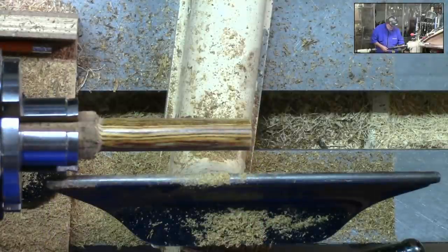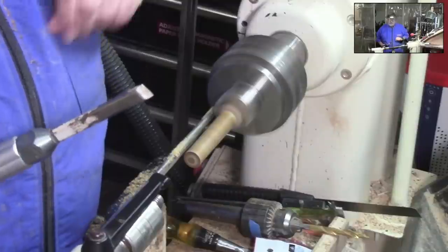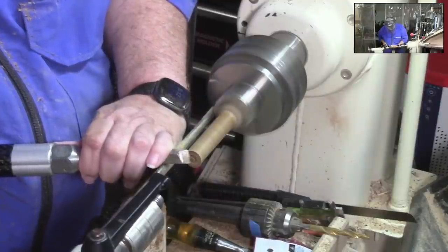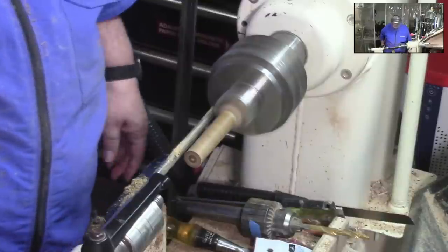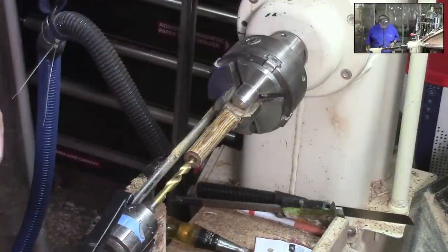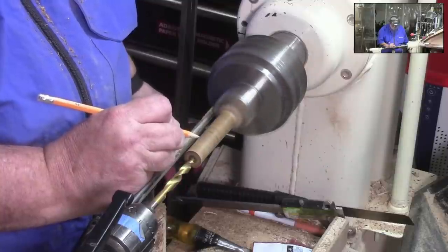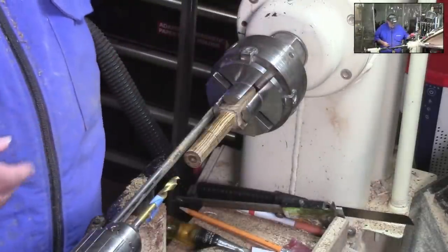So there's what we've got so far, and now we're going to work on this to make our whistle. I'll set that piece back over to the side and go ahead and start the lathe up again. Basically what we're going to do is come across here and just flatten that off. Once we get that done we'll come in and make a little divot in the middle — that's to give our drill bit a little better start. Now we're going to take a 5/16ths inch drill bit and drill up in there. We need to make some marks — an inch and a half deep with this drill bit. We'll mark an inch and a half on our drill bit and put a piece of tape there so we know when to stop drilling.